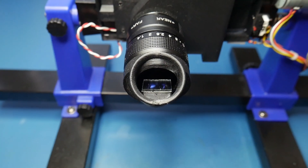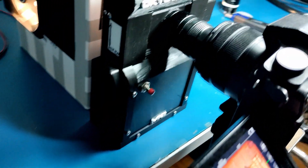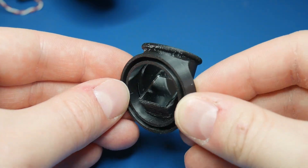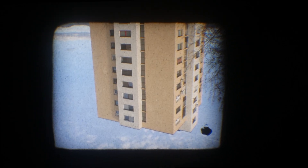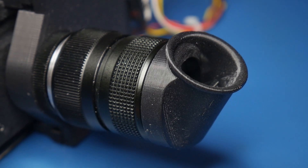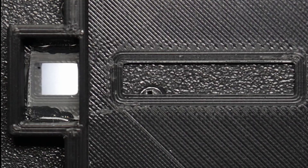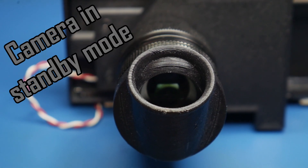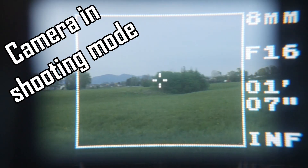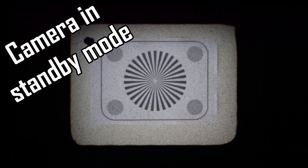The through the lens magnification is achieved using a cheap 25mm lens that also serves as a film scanning lens, and adding a simple image flip adapter in order to flip the image upside down. The through the lens viewfinder cannot be used during actual shooting due to shifting lens and multi-track physical limitations. The user switches between optical viewfinder and OLED viewfinder — there will be a button on the camera body that switches between these two states for easy operation.